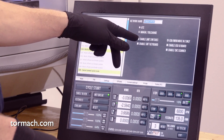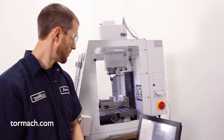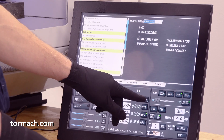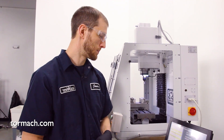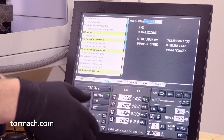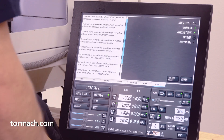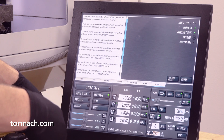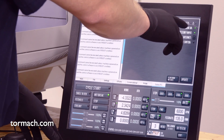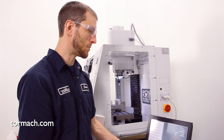So I'm gonna go ahead and re-enable our limit switches, and then we can reference the machine. We always reference Z first, and then we do Y and X. One thing to keep in mind is that the limit switch displays may change depending on what kind of machine you have — whether you have an 1100 with a door switch on an enclosure, or depending on the machine and accessories the display will change a little bit. But it all functions the same whether you're on an 1100, a 1508, or any of our machines.